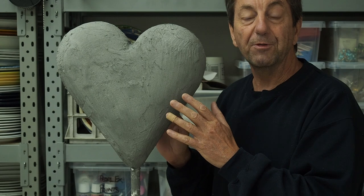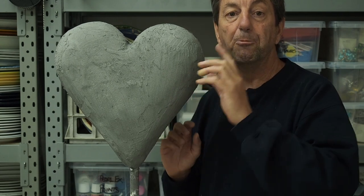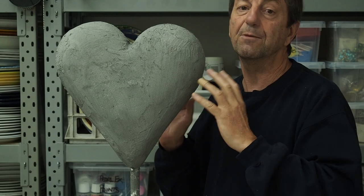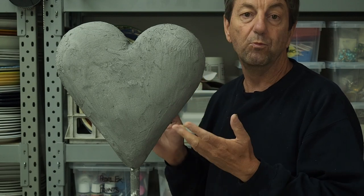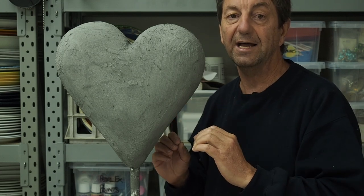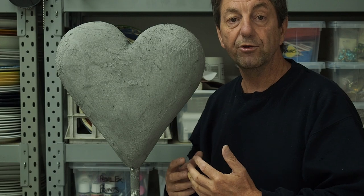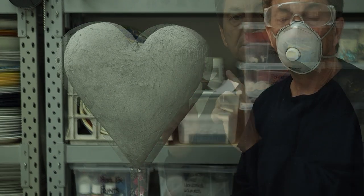Now, for those people that also want to know the products that I use to create this thin set, I'll put a link up the top here somewhere, and you can go and have a look at that video, and that will explain how I create the thin set and the products that I use. But any good brand thin set would be fine. It's just a matter of making sure you check those manufacturer safety data sheets and also the technical sheets to make sure it's going to be suitable for the substrate, the tessera you're using, and of course, the environment that it's going into. Right, we're ready to go.